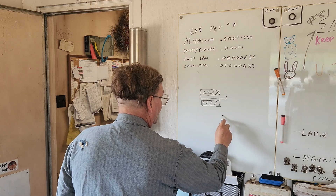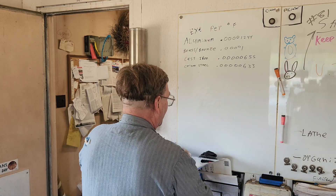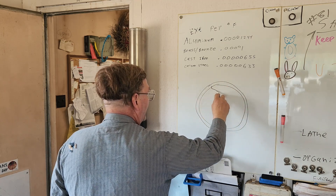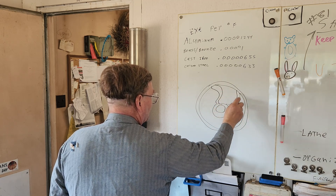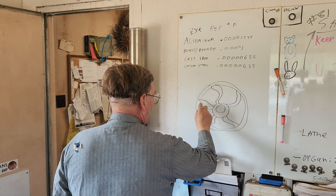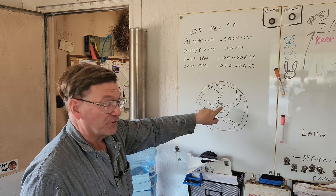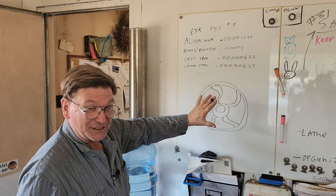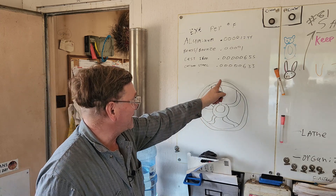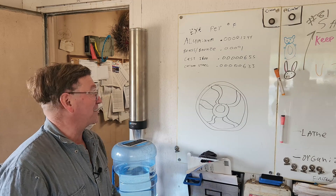Another thing to cover: here's a part with a hole, an outer rim, and some pretty decorative spokes with all kinds of different dimensions. You can heat the whole thing up in a furnace slowly and then drop it over a shaft. But go try and heat this with a torch — especially when it's cast iron, which most of these are. You're going to be breaking parts of those spokes. First time I did this, we had a break here and here in the spoke and it went flying big time. It was a good thing the man heating it was standing to the side — I instructed him; I didn't know any better. That was a long time ago, and a big mistake.